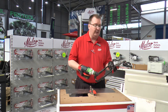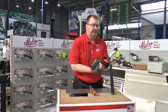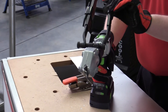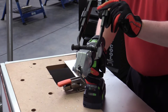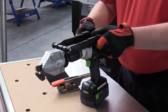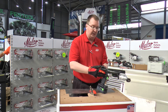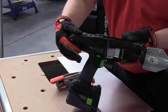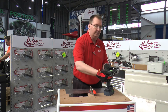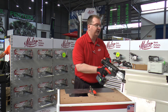The Turbo Shear Heavy Duty will chuck up like any drill bit — simply chuck it in and tighten it up. The arms of the drill clamp will telescope in and out to fit the length of the drill, and also open and close to fit the back end. Make sure the spacers are not blocking the air vents so you don't overheat the drill. Turn the thumb screw on the back end and tighten it down so it won't come loose, then check it to make sure it's secure.